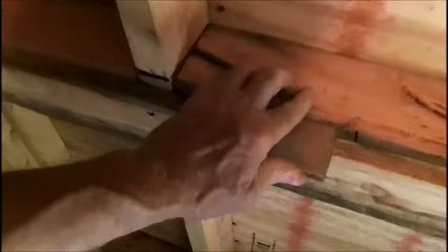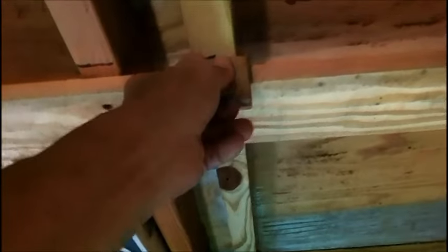I had put in two 2x4s on the horizontal here and everything's screwed in. That DeWalt screwdriver works really well. This here is some wood that came from the tub surround shipping — I save everything. It's a nice piece of wood that makes a good cleat. Now here's what I'm going to do — this is half inch plywood. I got this down a half inch so that the bench top, which is also half inch, will come flush to this 2x4 here. That's the same all the way around. I'm down one half inch, so that's where the cleat goes. The plywood will go on top of this so nothing can fall behind it.